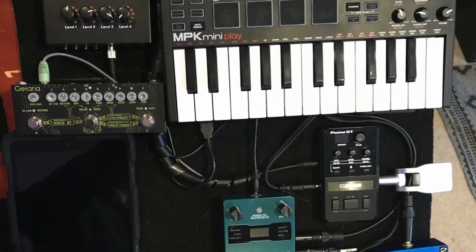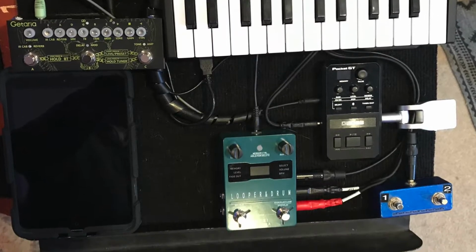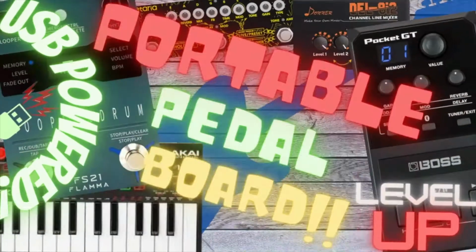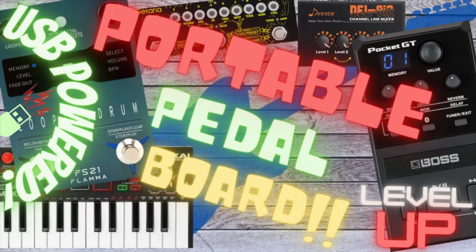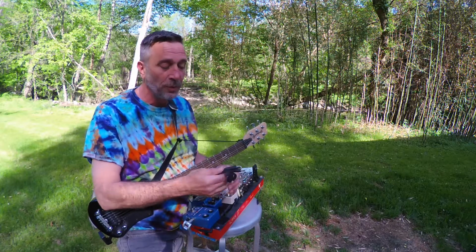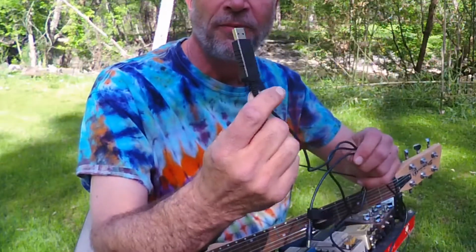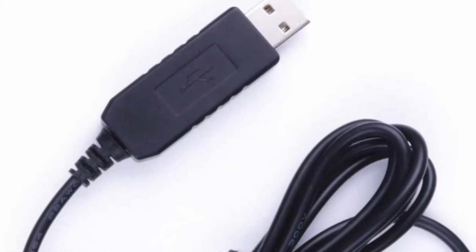If you saw my last couple of videos, you probably saw that I've been working on a portable creation board that has a keyboard and a looper on it, and I mentioned how I was powering that looper with a particular USB cable. It has a step-up voltage transformer in here. It's a 5 volt to 9 volt tip negative cable with a little step-up transformer on the USB end. I'll put a link to that in the description below.